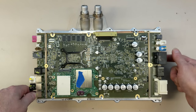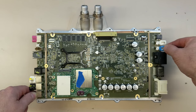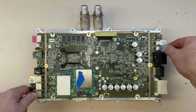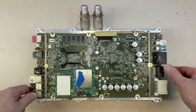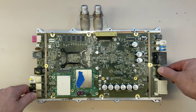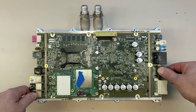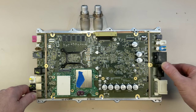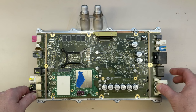This is a single twisted pair gigabit broad reach that goes to the autopilot computer — it basically just goes from here to here when the wiring harness is present. This is the Diag connector, also a single twisted pair gigabit, which is located on the screen. This is power input. This is some of the CAN buses, and there's a single twisted pair 100 meg broad reach for the radio tuner, some other things like that. And these are all speakers — mostly the front speakers and your pedestrian warning speaker comes off here.